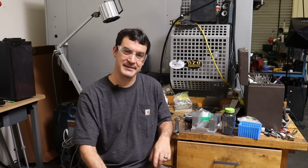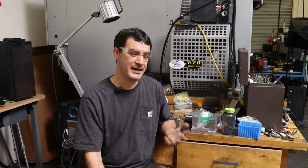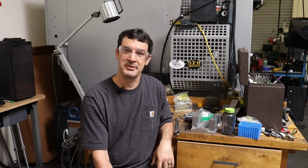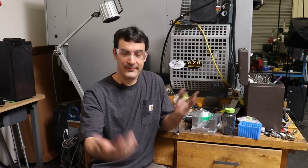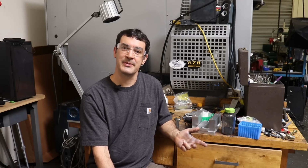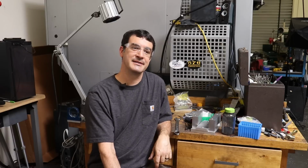Keith requested a 1,000th, or to have the shaft be within 1,000ths, and I translate that to total run out of 1,000. So I really have plus or minus 0.5 and I was about plus or minus 1,000ths out at the end. So to fix that, I've decided to scrap the first piston rod that we worked on, and we're going to start with a new one. So now I'm going to use the piston rod as a practice part.